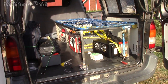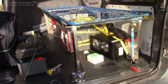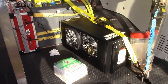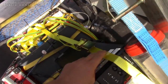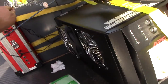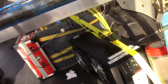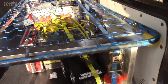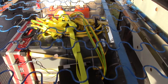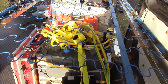Last night I was connecting all the electrics together, and today I strapped everything down and gave it the final touches. I've moved the inverter back here because it just makes it easier to strap down. I strapped that down along with the batteries — the batteries are strapped together forming pretty much a solid block and they're not going anywhere. I had a different solution at first, but when I did a very hard brake test the batteries actually moved out that way. So I made sure there's some force pushing them towards the fender against which they're resting. I think this is going to be plenty sturdy.